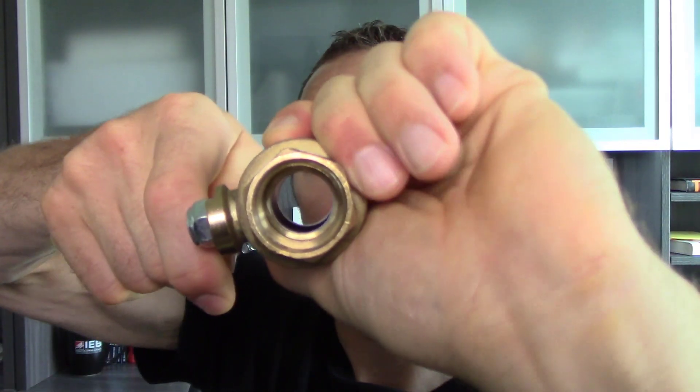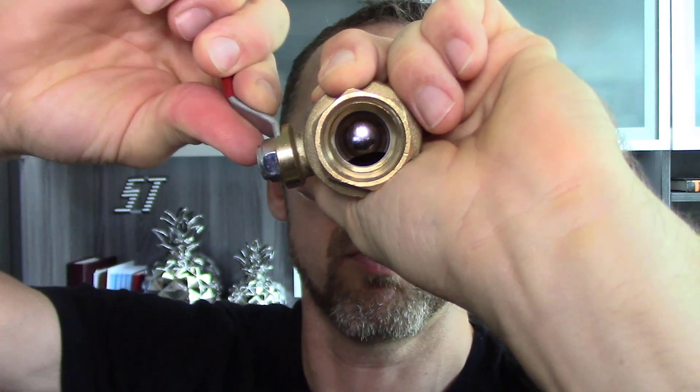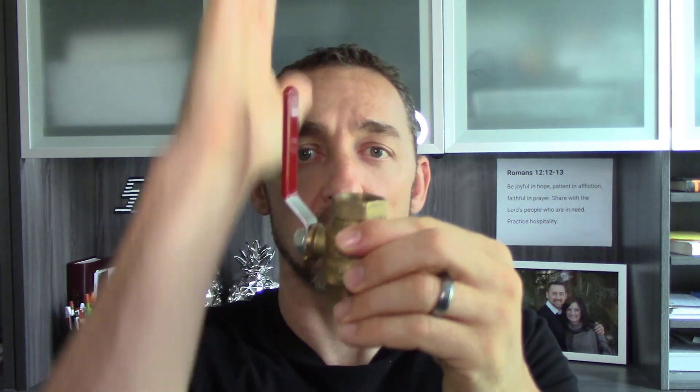And then finally, you've got your ball valve, also known as a quarter turn valve. These are good for water, oil, and gas. As the name implies, there is a ball inside of here. As we turn the valve, the ball rotates inside there to shut off the flow of whatever is coming through. To know whether these are open or shut, all you need to do is look at the handle. If the handle is parallel with the pipe or valve, it's open — you can see through it. If it's perpendicular, it is shut. I love that it's only a quarter turn. They're much less prone to getting stuck and much less prone to leaking.